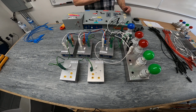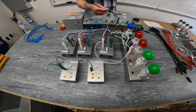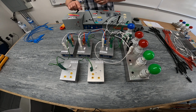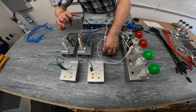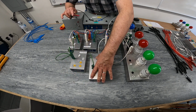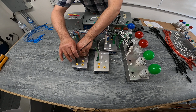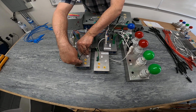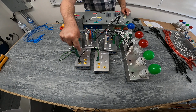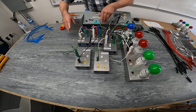two different locations. So first thing we're going to do is come from power supply a third time, and we will connect to the common of our first three-way switch. And I'm just going to tighten things up here just so I have enough conductor length, just a little bit more. So I'm making a power connection, power supply. This would be the common terminal of our first three-way switch.